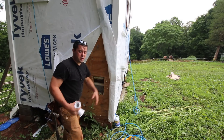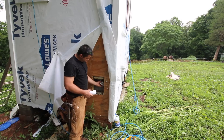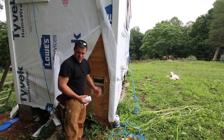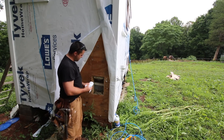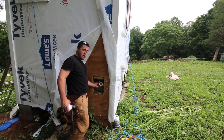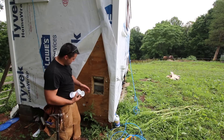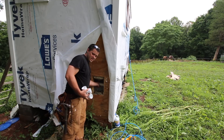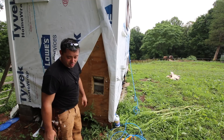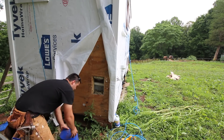I don't want the fill coming out over here anymore — I want it coming out the back. So I've got these two 45s, I'm going to splice that in there and splice this in here, and I've got a T that I'm going to hook up. Right now all I want is this pipe coming straight out, and then I can figure out what I'm going to do with the rest. I need to cut this pipe, which is directly next to my water tank — I'm definitely not allowed to cut that.